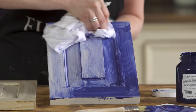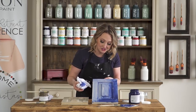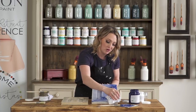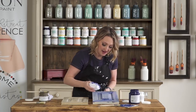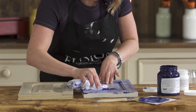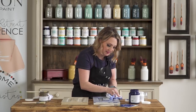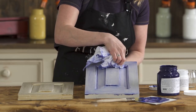That is a fun, gorgeous blue. The great thing about using a glaze is if it doesn't quite turn out exactly how you want it to, you can repaint over it a couple of days later, but you really want it to cure up completely. If you didn't like this look right now, it's so water-permeable that you could probably just add water to it and remove it. We're going to remove the excess with this rag. And once this is done, you want to wait about 24 hours and then put your clear Tough Coat over top of it to add extra durability and protection.